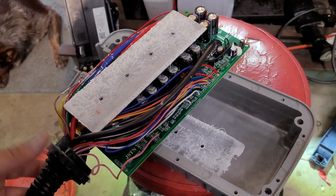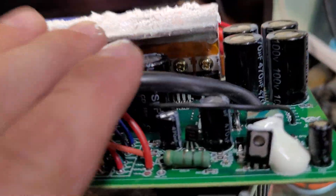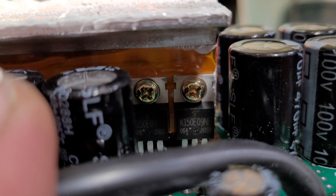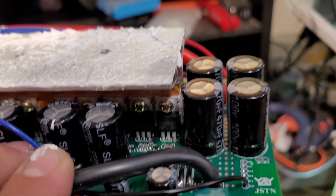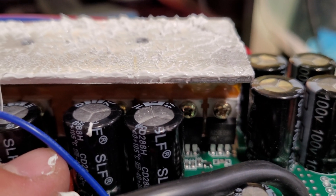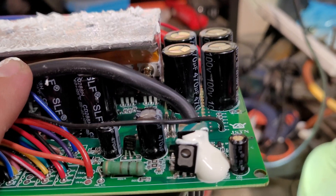I pulled that out — again, this is one I've already done. It's at 90 amps and I've got 150 amp MOSFETs. There are five on each phase — actually 10 on each phase total, so it's N-channel, with one on the input and one on the output of the phase.